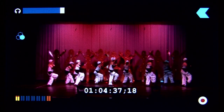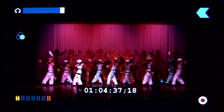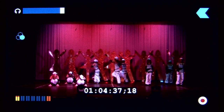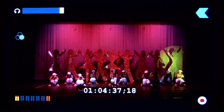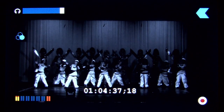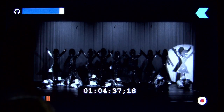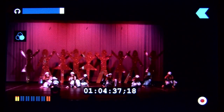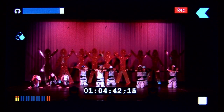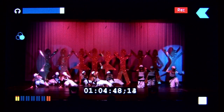Pressing the monitor button brings up a full screen, full frame rate color display of the incoming video signal, with audio monitoring at the lower left and headphone adjustment level at the upper left. The three blue circles on the left side are to enable the blue only mode, which provides a black and white display using the blue input channel. This is helpful for adjusting exposure on the camera and checking for noise in the image. Note that there's a record button at the bottom right — I can simply press that and begin recording video to the ProRes codec I set on the main screen. There's a red record indicator at the upper right, as well as a running timecode to let me know I am recording video.